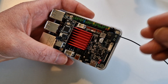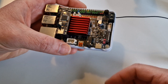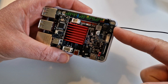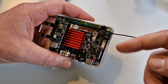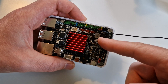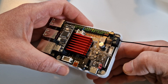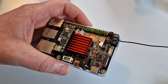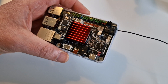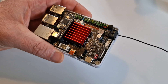There's another SPI breakout port, which is designed for an ADXL accelerometer for input shaping. It's not locked to that use — you just make a connector that goes in there, giving you a cable with power, ground, and four GPIO pins, which is pretty handy.